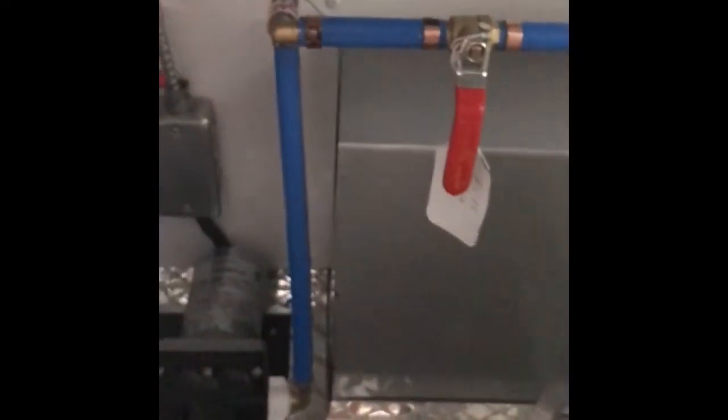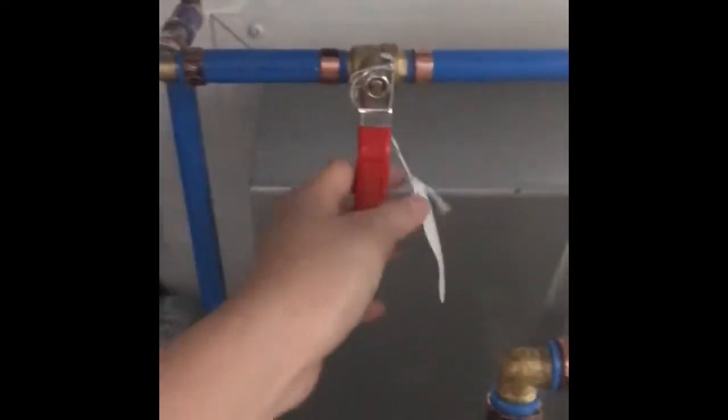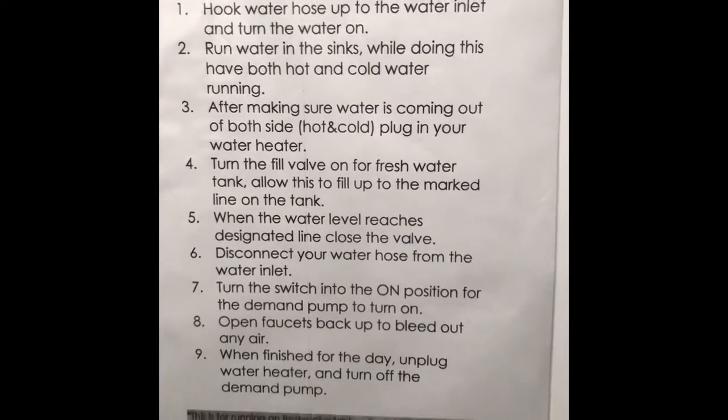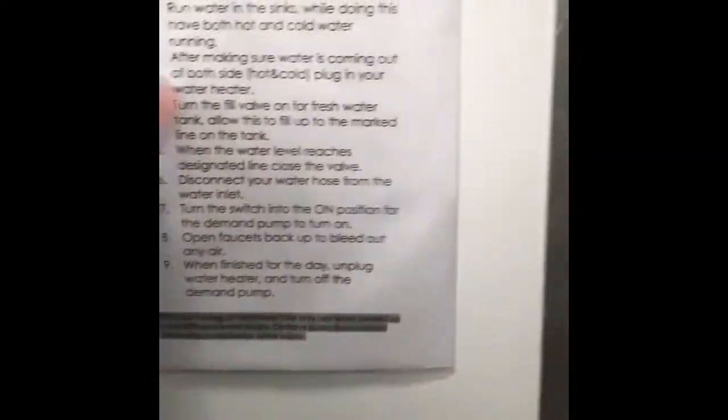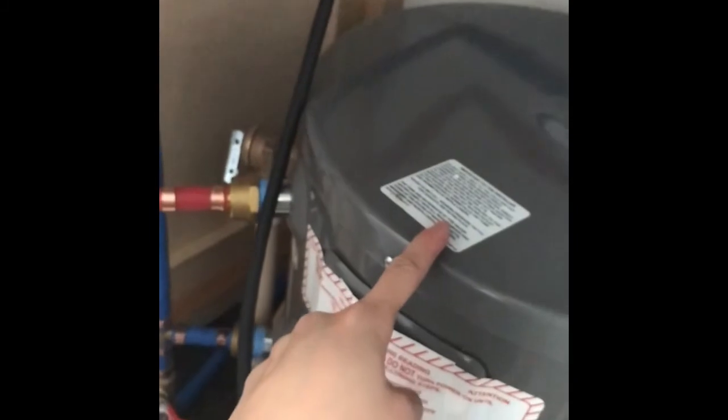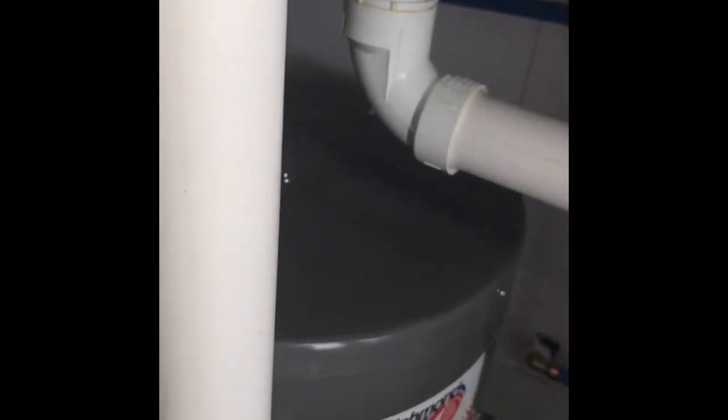Here is the switch I can turn on. Here is my water heater — make sure you have hot water, of course. I already put up a note about the water system so I don't forget how to use it, because before you turn the heat on, make sure you fill up the water first — otherwise it's gonna mess up the system and break your heater.